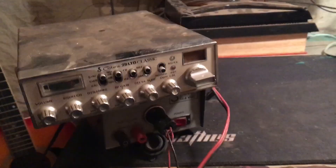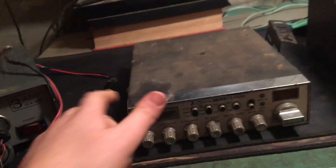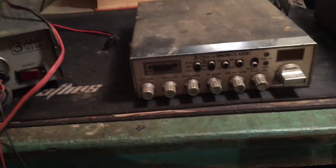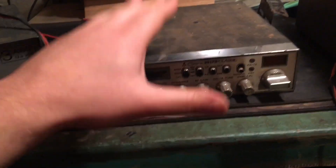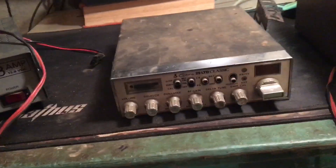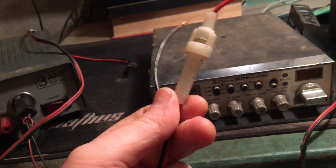Let's assume you wanted to use a mobile radio, like a 40-channel radio. On 40-channel radios, most of the time, they'll give an amperage rating on the fuse on the back of the radio. If they don't, usually for 40-channel radios — just standard garden variety — it's going to be about 2 amps. That's the fuse on your radio, and it looks like this — you got your little fuse plug here.